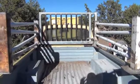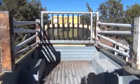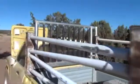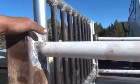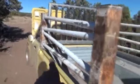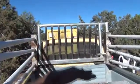We've finalized that third and final radiator and put it into place. I wanted to show you what it looks like with all the bed rail radiators now mounted — everything's up and ready to go. We have nothing left to do now but to put our finalized reactor and our double cyclone water cooling system that I've already showed you right into the top of this one. From there the smoke path is already ready to go — all the way through that first radiator, into the bottom there, up that first pipe and across, then back down all those one inch pipes into the square stock, up the last two inch piece of pipe, comes out of the bottom of the square stock, up that pipe over and into the top of our other radiator.